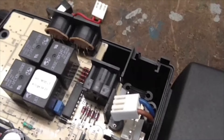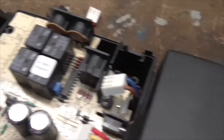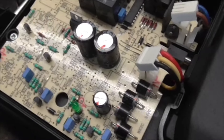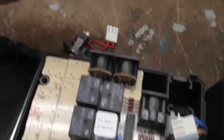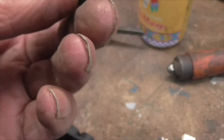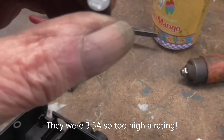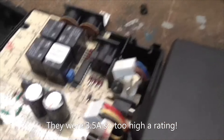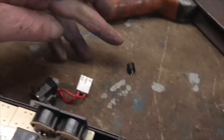This just shows you how it pays to go back to things — never assume that the answer to a complex problem in complex equipment is complex. Look at this: a little tiny plug-in fuse that goes in there and it's blown. One amp plug-in fuse. There's your problem — the main fuse is blown. This is a 240-volt fuse that divides the power feed from the motor feed.